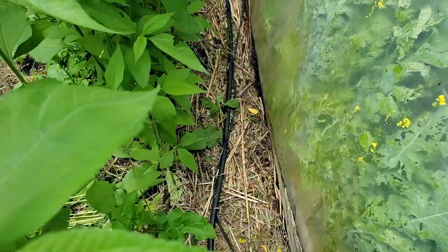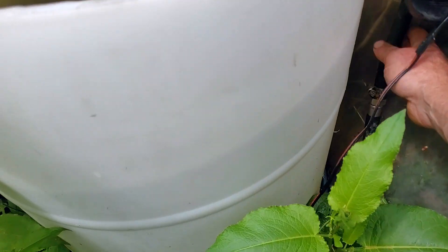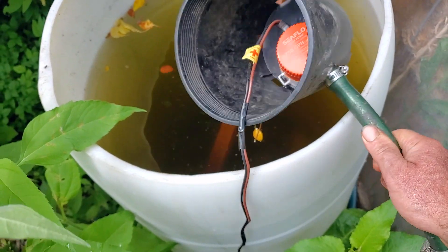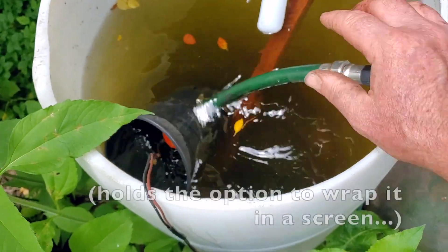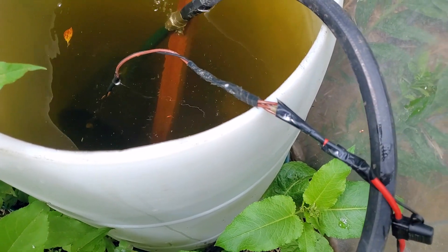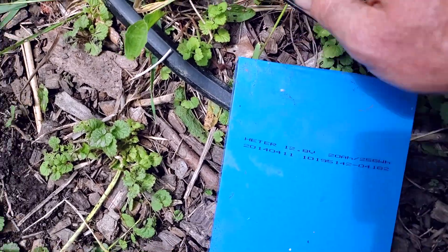There's a better way. I've got this hose here — a decent quality hose threaded onto — I'll show this in more detail in a bit, but let me demonstrate. We've got a 12-volt bilge pump; I've talked about these in the past. A $20 pump, 12-volt DC, and it's wired up. You can see I've got it in this container so it's a little bit easier to manage. We let that container go nice into the tank. It's a low-voltage situation so I'm not worried about shocking or anything like that. We've got a fuse just in case. You can see the float valve is refilling this automatically.